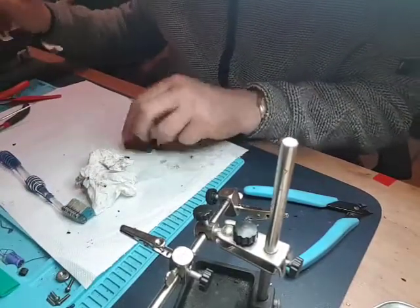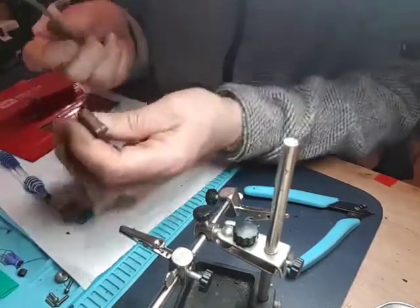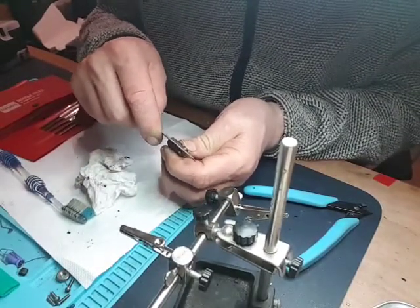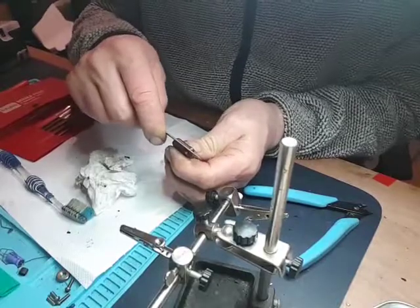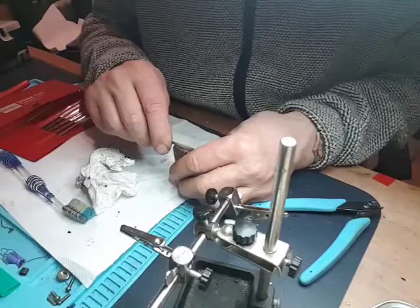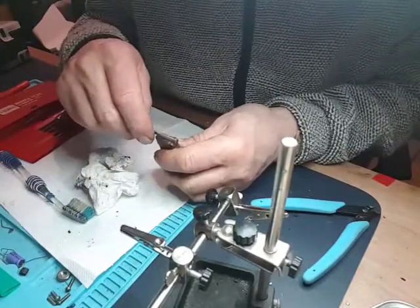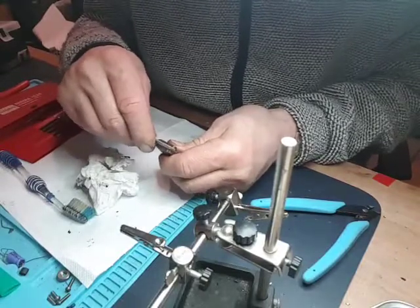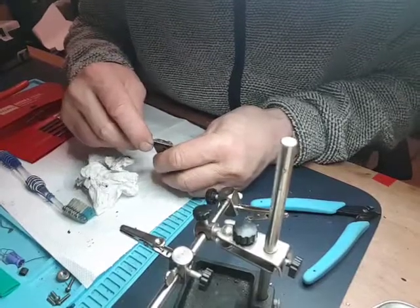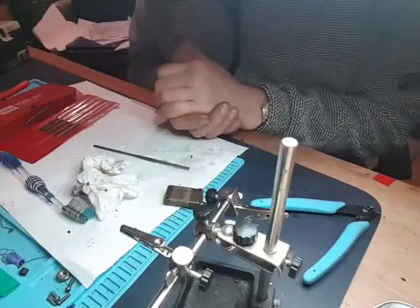I'm going to use a needle file and start to file away. A bit monotonous, a bit laborious, but shouldn't take too long. Just try soldering onto there directly. It's just not enough for the solder to take, so if I can file just either side of that, file into the capacitor. That's the next job. So, thank you for watching, and see you next time.